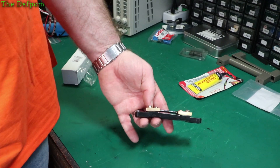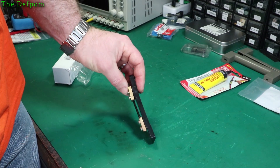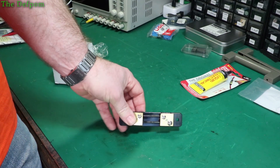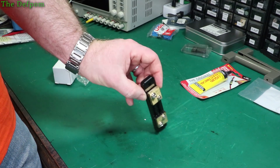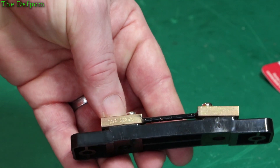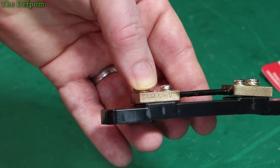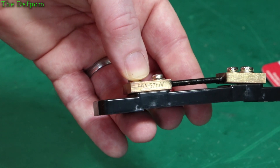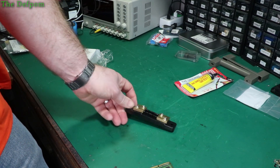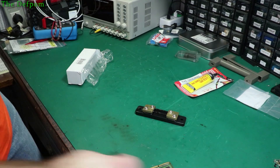Doesn't seem to fit on there very well — look at that, not very well assembled. Something got the measurements wrong. So this is a 50 millivolt, 50 amp shunt — for every amp you get 1 millivolt, in theory. Although I don't see any markings on it saying what it is. Oh, there we go — it does say over here: 50 amp, 50 millivolt. I'm going to have to maybe make the marking a bit more obvious. So this means I can do the 50 amp calibration I need to do on my DC load with good resolution. This might get a bit warm but that's fine. I'll do a video on that when I get to it.